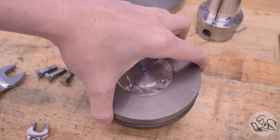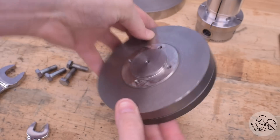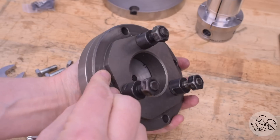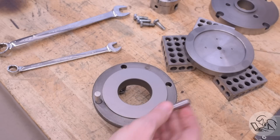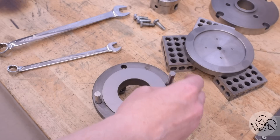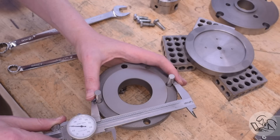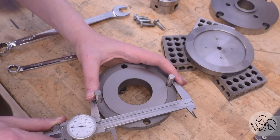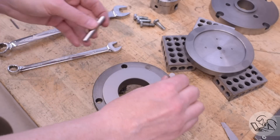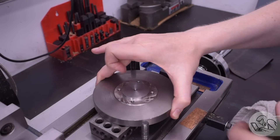Survey says — perfect. That's clearly how that's intended to be used. I'm sure it's not an accident that that's a perfect fit on a generic six-inch plain back chuck mounting plate. So that is definitely the way to go. All I've got to do then is replicate the bolt pattern in the supplied plate. I'll measure the diameter of that bolt circle and transfer it to the plate. This doesn't have to be that accurate because the chuck mounting plate has extremely generous clearance holes, so calipers and pins is plenty accurate enough. You could also transfer-punch these if you had the right size transfer punches.